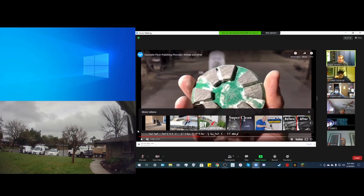And the reason we use diamonds, even synthetic diamonds, is because they're the hardest known substance on the earth, right? Therefore, a diamond is going to do a great job of polishing or grinding any stone. So generally speaking, anytime you're polishing or grinding a stone, you use diamonds. Same process is used for marble, for polishing it, because it's using a diamond system. Granite is using diamonds to do it. Terrazzo, all stone floors that are created, they'll use a diamond process, unless it's something like a tile, like a porcelain or ceramic tile. Obviously, they don't grind or polish those. Those are made in the factory.